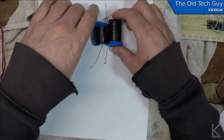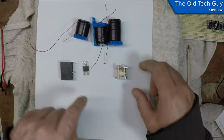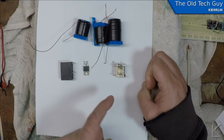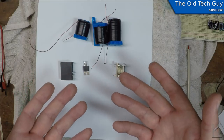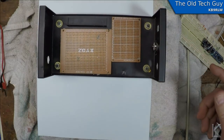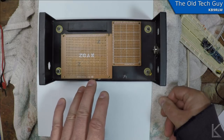The inductors are all done. There's the IRF640 output transistor, and I've found a couple of relays for the switching: one will be the transmit/receive relay, and the other will ground the receive antenna when going to transmit mode to protect the receiver. You don't want to feed strong RF down to the receiver, but there will still be a little RF coupled in so the receiver becomes your sidetone monitor and also useful when spotting the transmitter. I've started getting parts together and need to start assembling the board. In the chassis it should be a nice clean little transmitter.